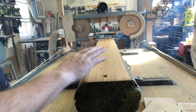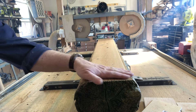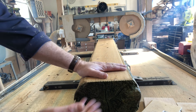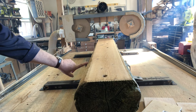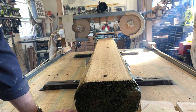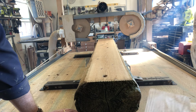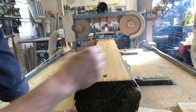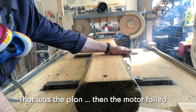That cut went very nicely - just a three-quarter inch turned to probably be five-eighths finished cut. I'm going to drop down another five quarters, but I'll have to move these log clamps down a little bit to get some clearance for the guides. Actually, I think I'm going to go up five quarters again, so I'll raise the log - the reason being just to give a little bit more clearance on this side as I don't have much adjustability here.